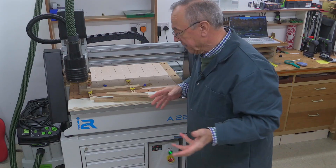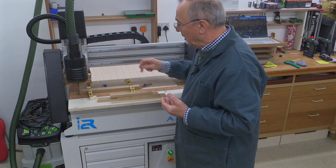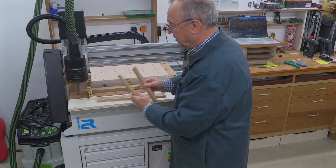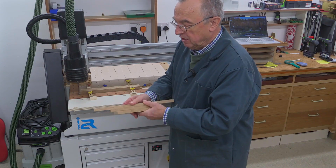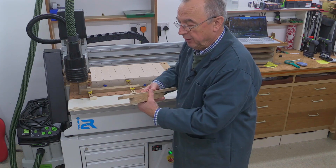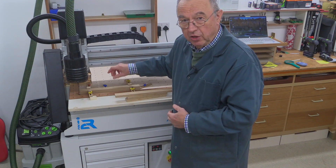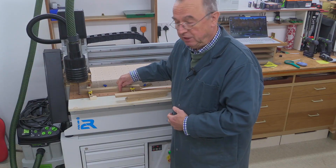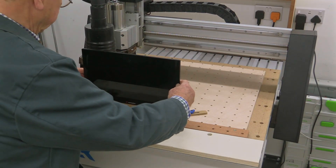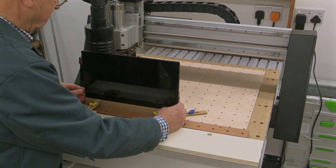I'm now back at the beginning with four pieces of wood that form the frame. One is already mounted ready to be cut on the CNC — it's the bottom piece. I've got two side pieces and a top piece, all made of oak. The top and two sides are 14 millimetres thick by 34 millimetres wide, and the bottom piece is 34 millimetres wide and 30 millimetres deep. I've cut that bottom channel and the idea is that the screen sits inside it — it fits nice and snugly.